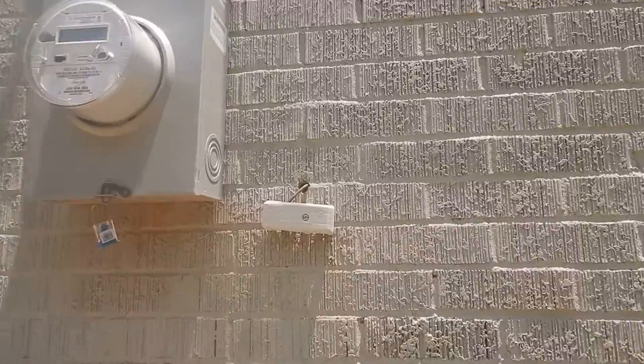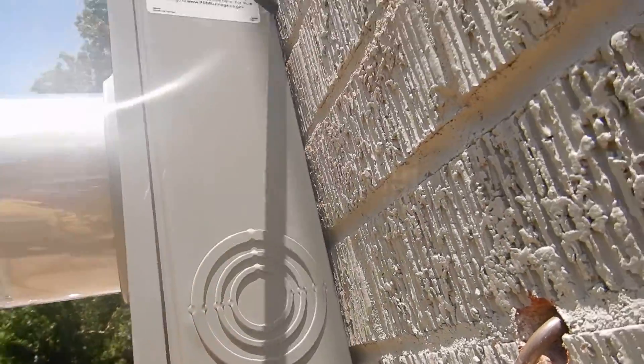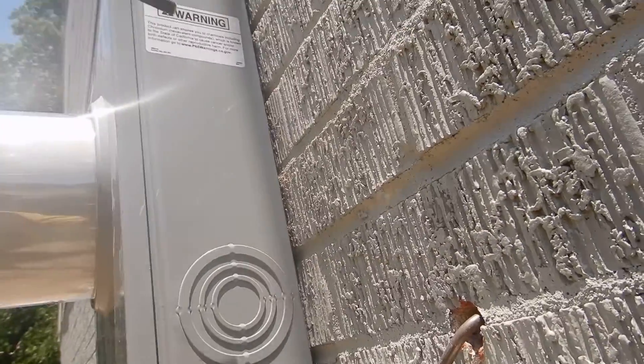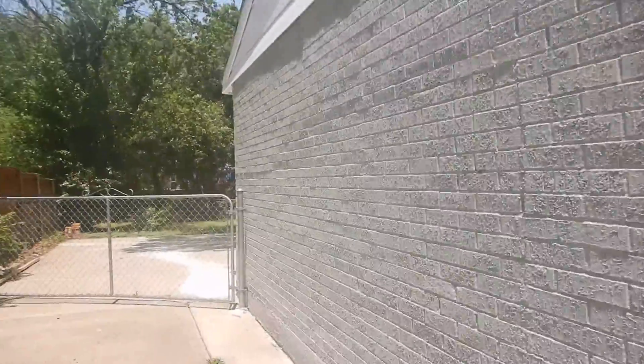The meter is on the west side of the attached garage. This box should have been sealed on three sides to help prevent moisture infiltration from getting into the structure. It should have been sealed.